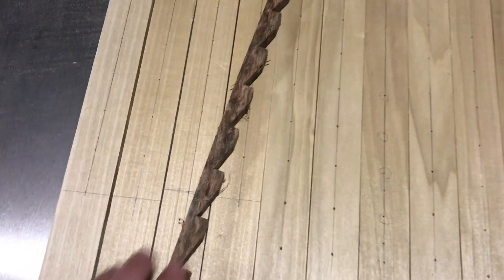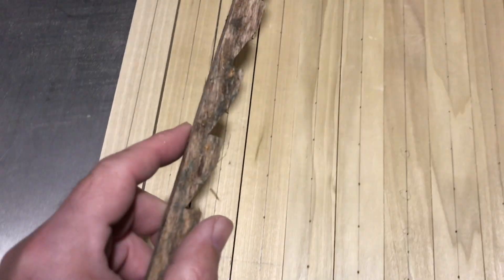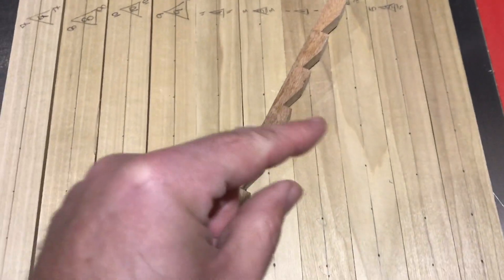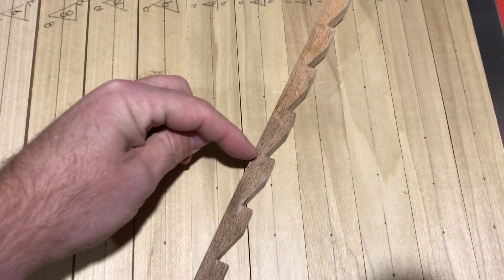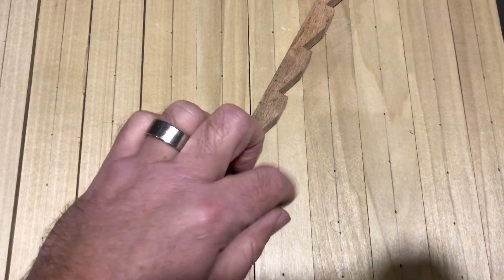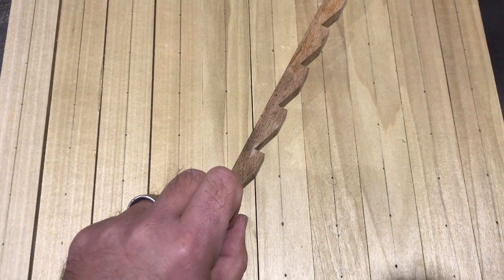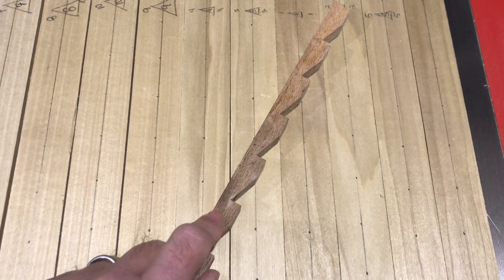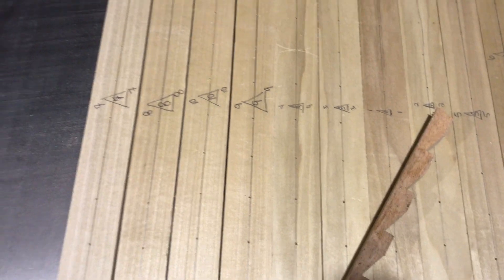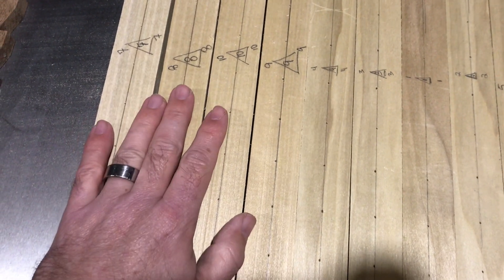One of them is the way that the French do it — and if I had to do this by hand without a drill press, I'd probably do it this way, just with a saw. The stretcher, instead of being a stretcher with a round on either end, hooks into this mouth and sets on. Both systems are just as strong and work really well. This way lends itself more to a little more modern production with either a drill or a drill press. Here are all of the makeup sticks in order to do the adjustable shelves — I've actually got ten sets of two, so it's enough to do five cabinets. And then I went ahead and milled up all of the poplar for the stretchers too.